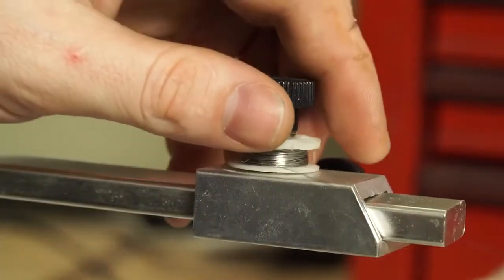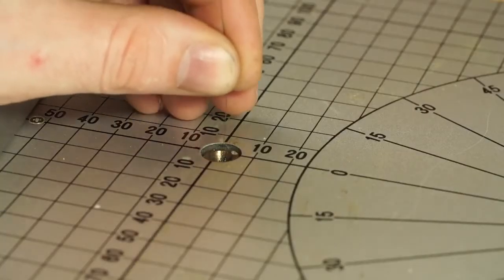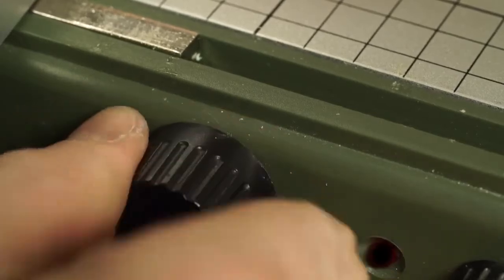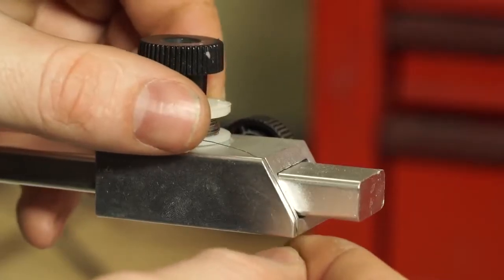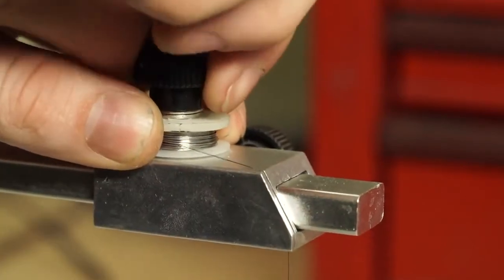Loosen the wire spool and pull out a few inches of wire. The top of the hold down is shaped like a funnel, so the wire is easily inserted inside. After inserting about a ½ inch of wire into the hold down, it is retightened. Align the wire through the guide slot while turning the spool to make the wire taut.